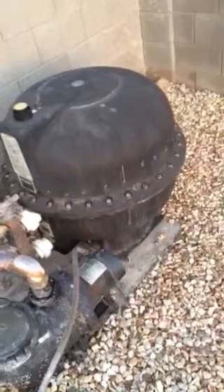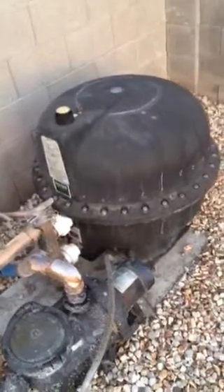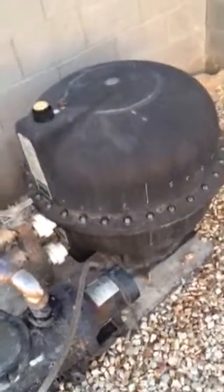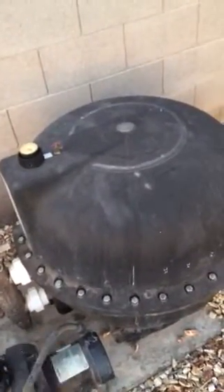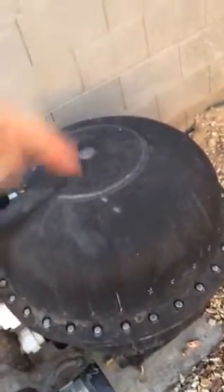For the remainder of this video, I'm going to walk through the process step by step, as simply as I can. I'll include a link to the instruction manual and a list of what I purchased in the comments. The first steps were: shut everything down and backwash it, then release the air pressure, release the drain plug underneath, and then undo each bolt in a counter-rotation pattern —